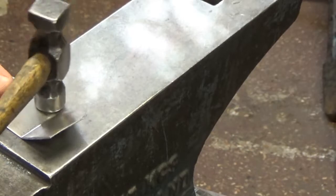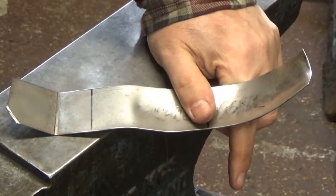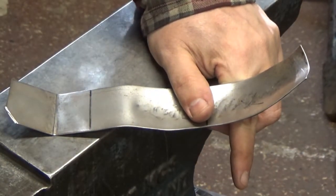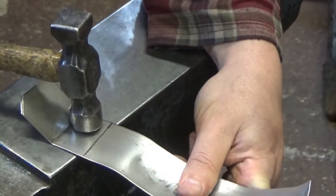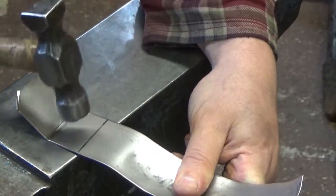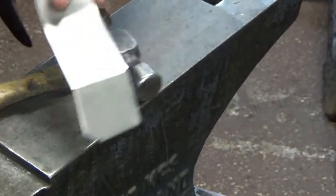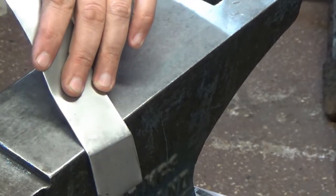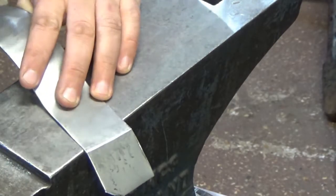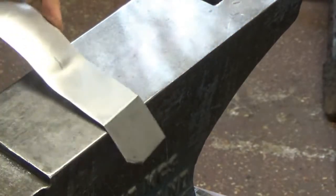Then all you do from the back — chase it back down. Particularly if you're doing things like greaves, which have been really shaped and bent on all angles, you need to push this back down from behind. Because otherwise when you clean it, you'll get all these little hammer marks along your crease and they look horrible. Just gently touching that back, and there is your crease. We catch it nicely in the light. Nice and easy — you can sharpen that up with a bit of cleaning. That's how you can do it over a piece like this.